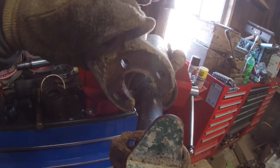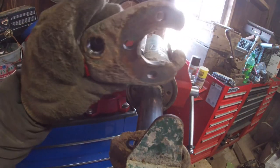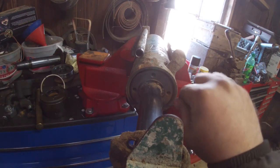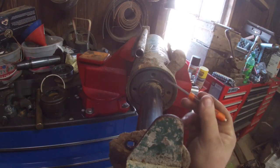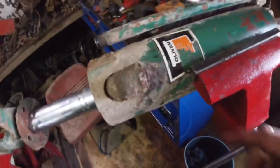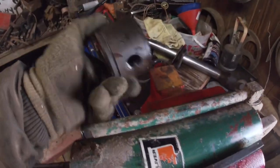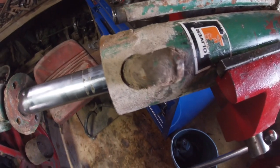Just a few taps with the old Snap-on multi-tool and you get this off. You see it's nothing more than a cast piece with an elbow and it has a place for that shut-off valve deal to go. Now we're down to the head end of the cylinder. What we need to do — and this might surprise people — we need to drive it in because there's a snap ring inside of here that holds it from coming all the way out. So we have to tap this in, take the snap ring out, and then pull it out. An important step I almost forgot: before we drive that in to get the snap ring off, we have to get this elbow out because it goes through the outer barrel and into the head piece here. So that has to come out first, and then we'll try to drive it in with a brass punch and get our snap ring out.